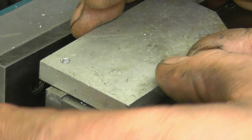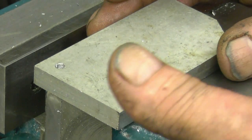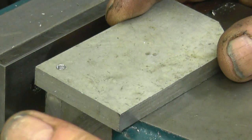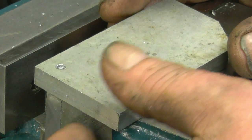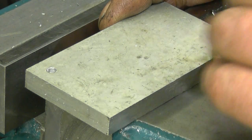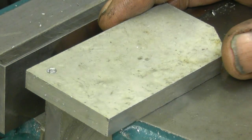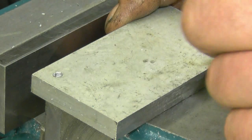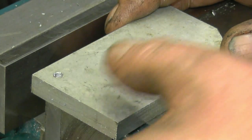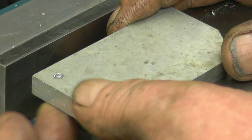When I was installing the DRO, I'd made a bracket out of 10mm aluminium plate and there were two drilled and tapped holes — 4mm, 4×0.7. I'd had the thing together and apart that many times the threads had become very weak. I haven't got a 4mm helicoil and the 4mm helicoil kit is expensive. What I thought I'd do is bore the back of that out and put an insert in with a thread in it. What I ended up doing was using a 7mm milling cutter to counterbore it, and then a 4mm nut was a really good press fit in there. I'll do this one to show you — it really worked well, it's a good dodge. A lot stronger than just a thread in straight aluminium.